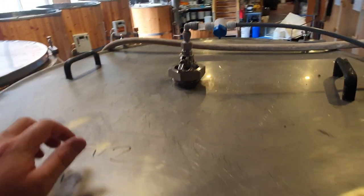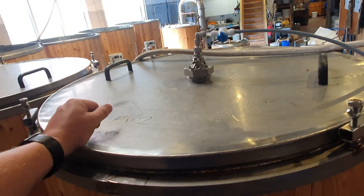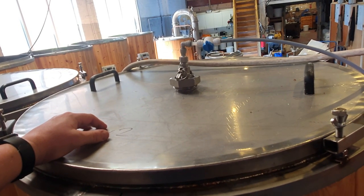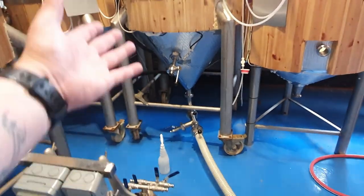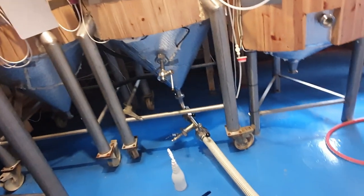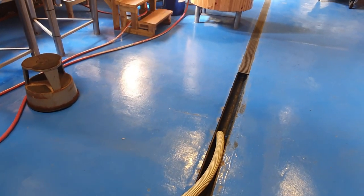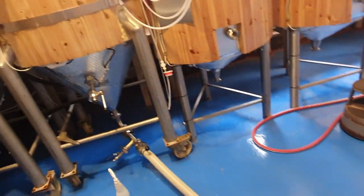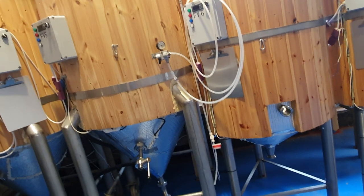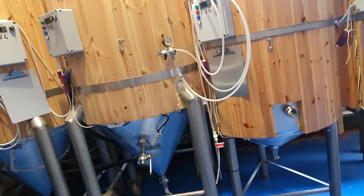That's what we do because we don't have sealed vessels — we have to work with these open-top ones, it's the best I can do with it. Just to give you a holistic view of how the pipework is set up: we've just got one of these rigid pipes and we pop it in the drain like that, so when we drain the rinse water, the caustic and the acid, it all goes down into our municipal sewer. And then this tank is clean and bright and ready to see some fermentation action.